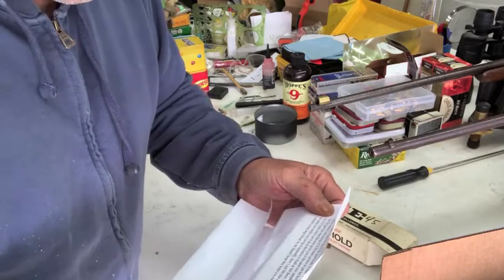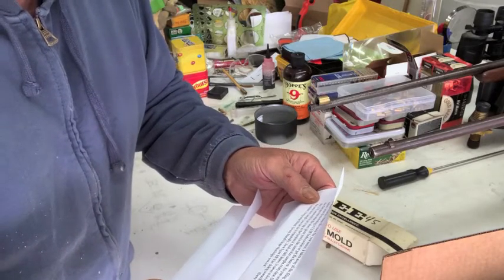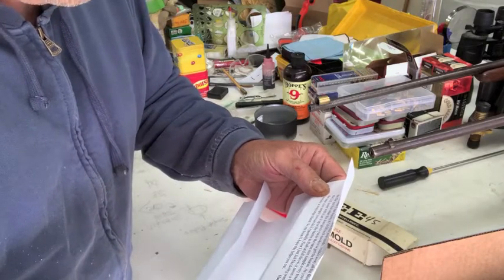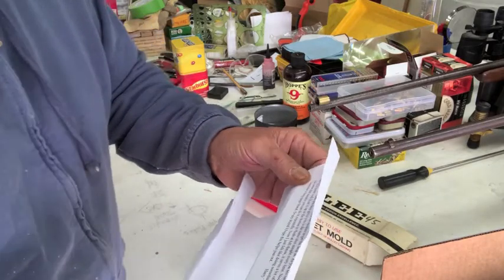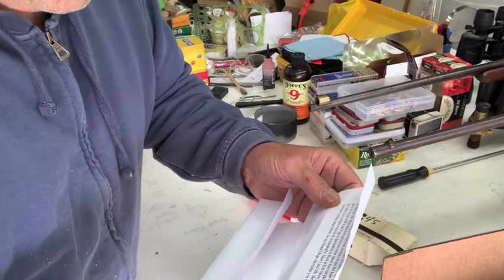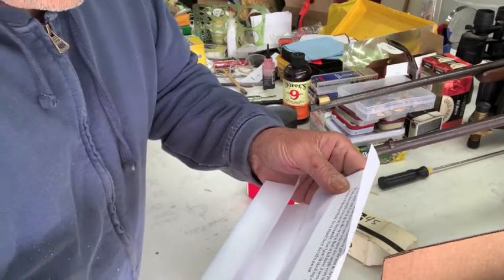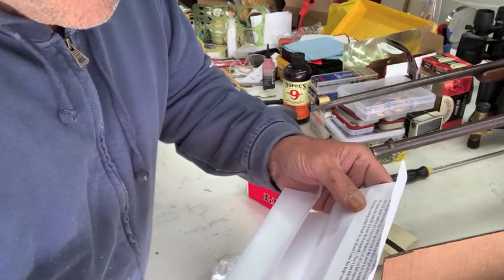Hi there, Charlie. I hope this mold fits your needs. It takes away all the filing you had to do before. When I was testing, I'd fill both cavities to get the heat in. As you see, only one side has the flat spot, but this does give you the same size dimple every time, or same size sample. Now, if you're using the lead tester with it set up so that the button is flush at the full throw, it'll save a lot of time, and with your size sample, you can do it repeatedly. Now, I just felt like doing something nice for a guy I consider a long-range friend. So my friend, I hope this helps you out. Harry.